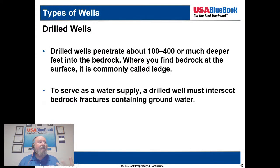And at the time, that aquifer, when it wasn't being pumped, all of those wells were artesian wells located in San Bernardino Valley. And so in the wintertime, our agency benefited from that artesian well flow, because we didn't have to run the pumps to get water. We could average about 15,000 gallons a minute artesian flow from those wells that we'd normally pump.